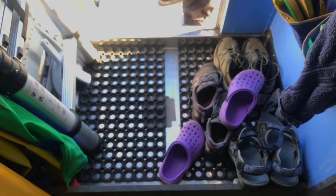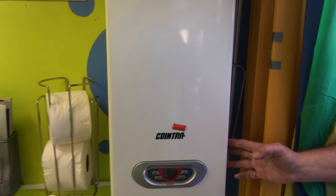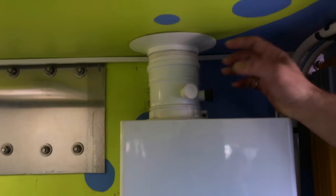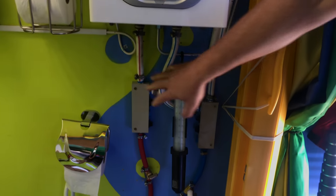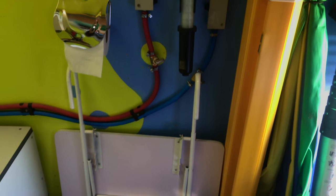Yes. And this is the shower, actually. It could be the shower. Can you show me now, because we talked about the hot water. Yes. How do you heat? It's a normal propane heater. It's secure to use inside. A double exhaust, with the fresh air coming inside and the dirty air going outside. And here comes the propane inside, and hot water, cold water. Nice, and that's the system. The exit here is for the outside.